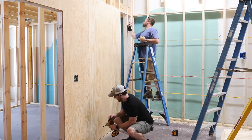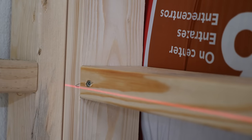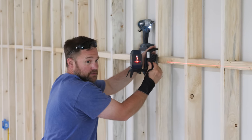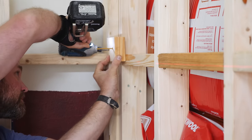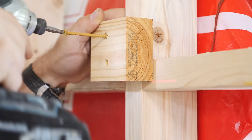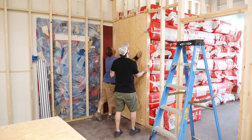Next, we moved on to the plywood walls, which were much easier than the drywall. We actually started this process a few weeks ago, prior to installing the insulation, covering one side of the partition wall. First we made a mark at about 97 inches off the ground, then set up the line laser at that mark. The extra inch of clearance off the ground would allow us to keep the plywood lined up while staying clear of the undulating floor. We tried a technique using scrap blocks of wood mounted in line with the laser to butt the sheet against, but the edges of the plywood weren't dead straight, so it was easier to just line the sheets up with the laser by eye.